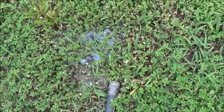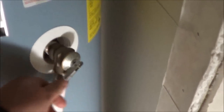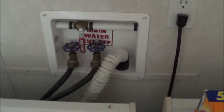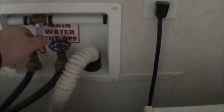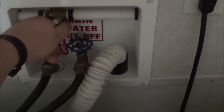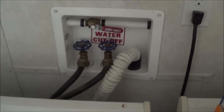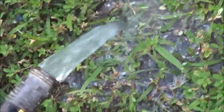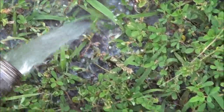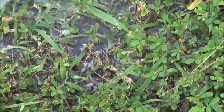Now let's go over what to do once it's finished draining. Next, go ahead and turn all the water faucets off, then turn the emergency valve back off. Once you have all the hot water valves turned off and the emergency valve turned off, you can go back and turn the main cold water on, or turn the cold water on to the hot water heater. See all the minerals and stuff that comes out of the water? This is everything that's in your water tank, and this is what you're going to be flushing out. Do this for about five more minutes to get all the material flushed out of the hot water tank.